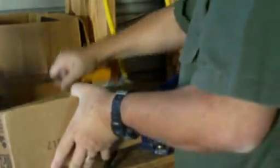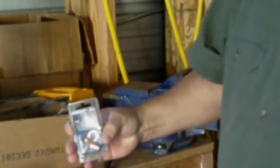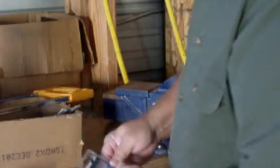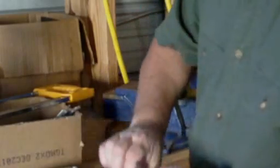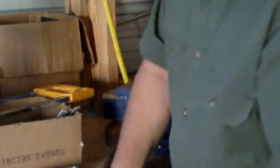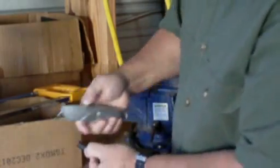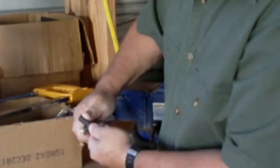The terminals that I use — because they're inexpensive — if you go to Harbor Freight, you can buy these terminals. They sell them for number 4 cable and for number 2 cable. These are welding cable lugs, so you'll find them in the welding section. What you want to do is grab one terminal, put your cable on it, and see how far back you have to cut the jacket. You'll have to cut it right about there.